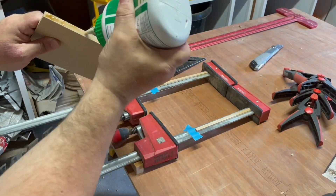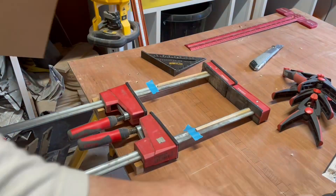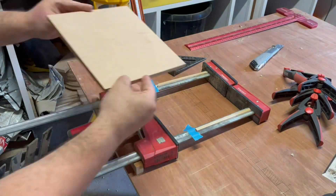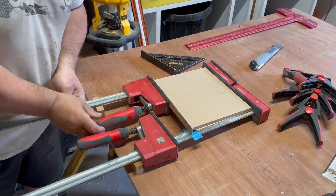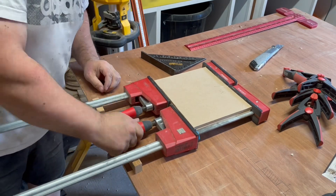The customer decided that they wanted oak. What I'm doing here is using solid oak on all the exposed MDF edges. I much prefer doing it this way. I don't like using iron-on edging — it doesn't last as long in my opinion. It's a little bit more work but well worth the effort.